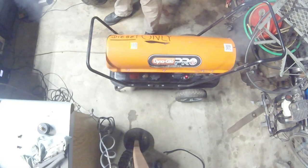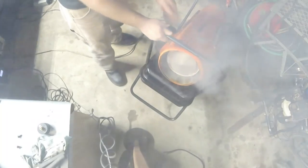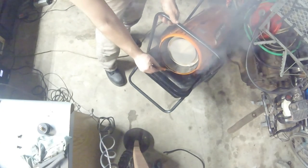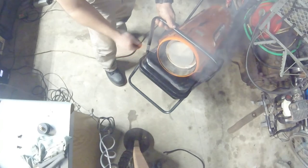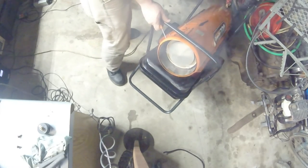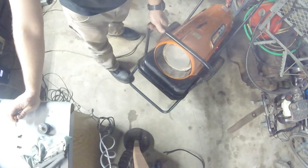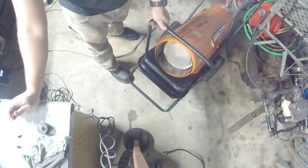There is a lot of diesel in here. There's an inner chamber and an outer sleeve - that sleeve had liquid fuel in it. There's still a little bit of liquid there, and also leftover soapy water from cleaning parts. This thing needs to come up to full temperature. We're not dumping fuel out the back anymore, so that's a good sign. There was definitely fuel coming out the back, and we've seen flying bits of carbon coming out. I'm going to run this one a little while off camera outside and see if we can get it to clear up.